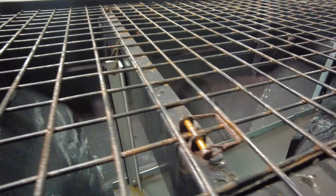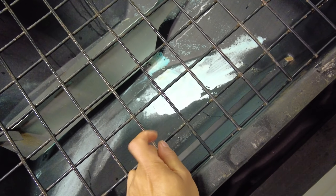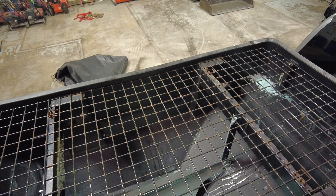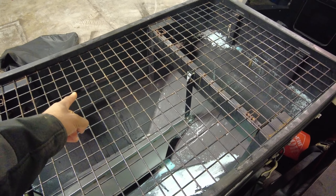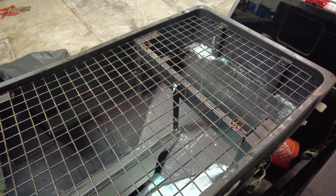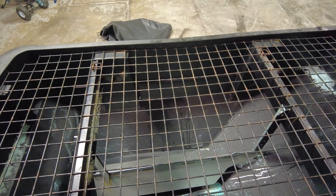How handy is that on the 23 Super Duties to put your foot into that step. We're going to be adding a vibrator to this spreader today because they give you one right here where you can see all that salt is accumulating. But with the one vibrator, I end up getting the most uneven feeding of the spreader. It ends up just emptying one half, leaving the other half of the spreader full, and all the material doesn't come out. Then I turn on the vibrator and have to leave it on because it has to vibrate everything across the whole spreader. So I'm hoping that if I add a second vibrator, it will feed more evenly and ultimately flow more material out.